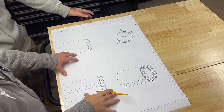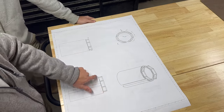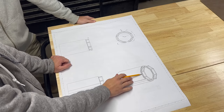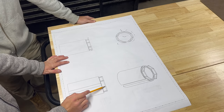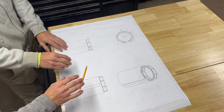We got all our wood milled up for this, and it's all dried out in the kiln. So I'm thinking we start out with this lower section. So we got our main headers, and then our main support beams and our sills, and we're gonna put windows in there at the end, mortise and tenon on all of these, and then peg it together. So I think if we start with that.